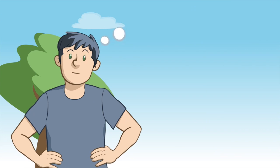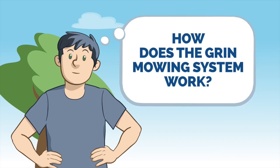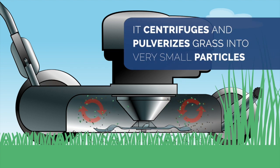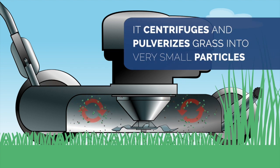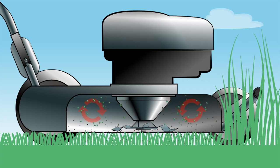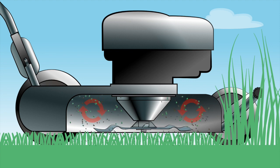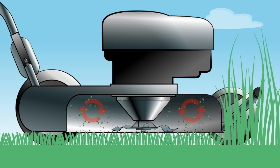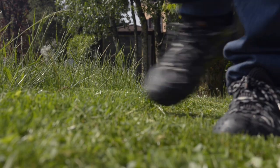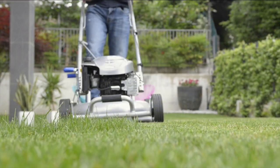How does the Grin cutting system work? The cut grass remains suspended inside the mower deck. The movement of the blade, combined with the effect of the Grin helical disc, creates a vortex that centrifuges the grass. In this way, the grass loses most of its volume and gets pulverized into very small particles that are virtually invisible. These particles do not remain on the surface of the turf, but fall directly through to the soil and are absorbed.